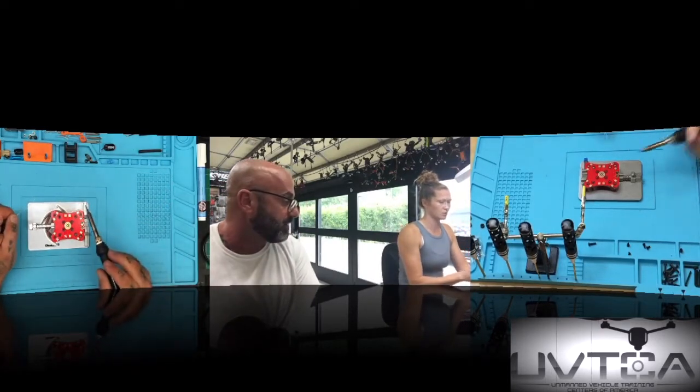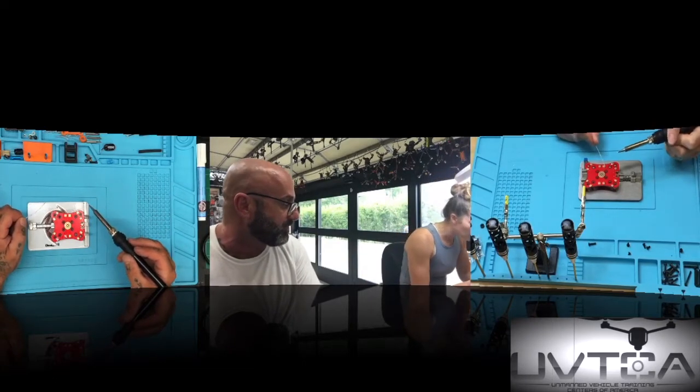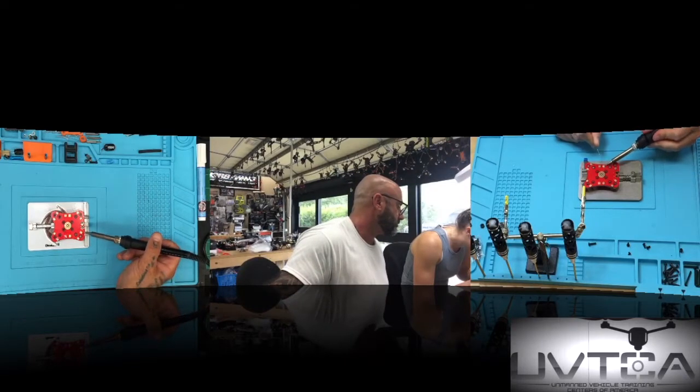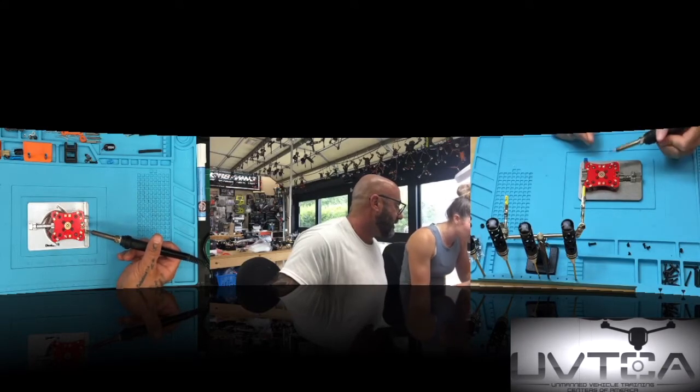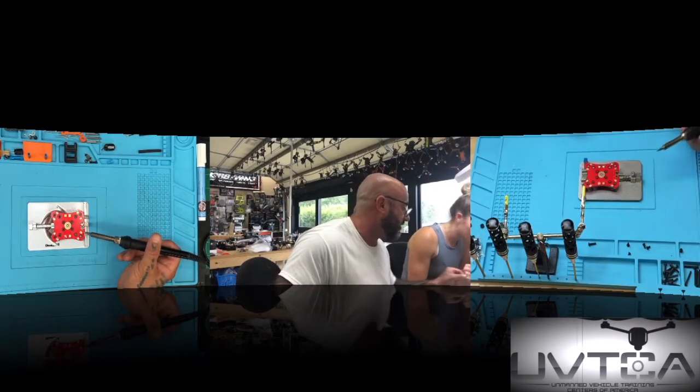So now that I did this one square, do I go back to my square? No, you're still good. So now go ahead and color the next one. Yeah, try to put the solder in the middle of the square. There you go. That's it. Okay. And then you can do the next one. It just like disappears on you. Well, you gotta keep feeding it solder as you go.